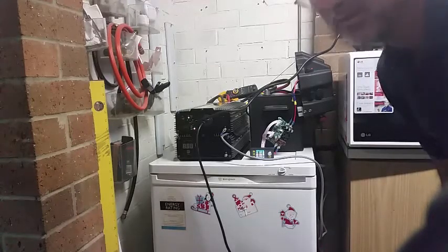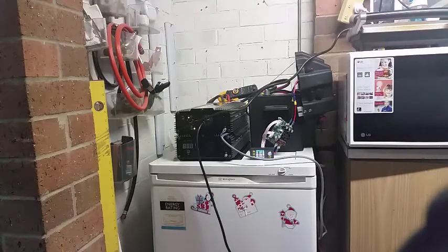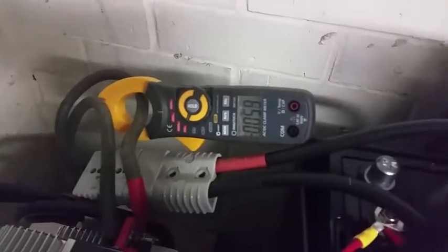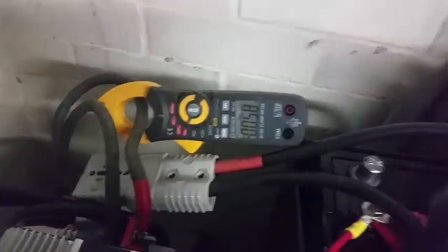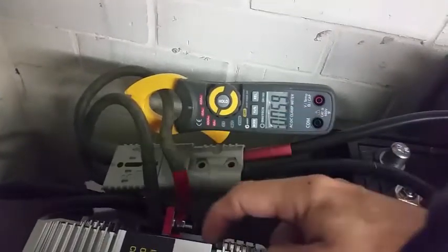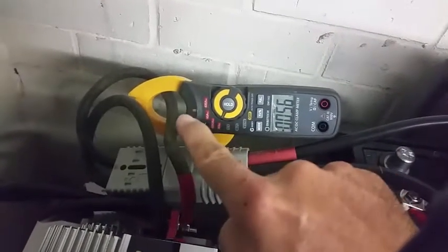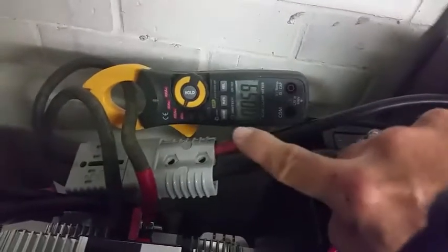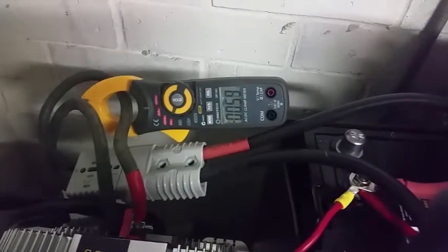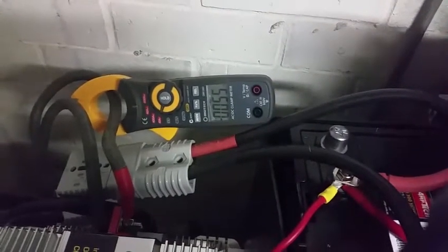What's cool is that if I cut 240 volt power to the inverter, it will switch over and then use battery power to power the freezer, acting as an uninterruptible power supply — which is pretty cool. So that's what I'm going to do right now. So that's the power switch there for the inverter. I'll just turn that off. Now have a look at this ammeter here, which is showing a trickle charge. You can see that it's negative — the way it's oriented is saying that power is going out of the inverter or the charger into the battery. Now watch what happens when I flick the 240 volt switch to off.